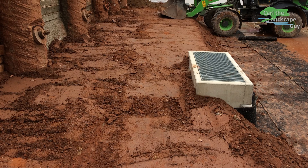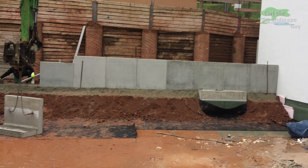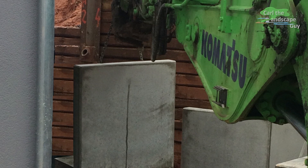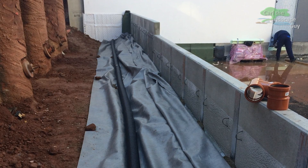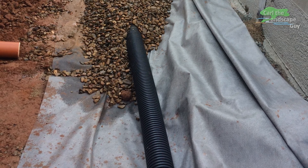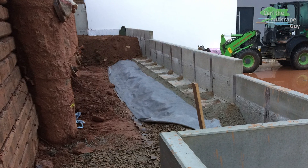The first row of angular panels can then be placed on top of it. The pieces are set with an excavator, and sometimes the excavator driver puts into effect his special skills to set them right. Behind the wall, there's a drainage package consisting of a drain pipe, gravel and fleece fabric around it. Then it can be backfilled and compacted.